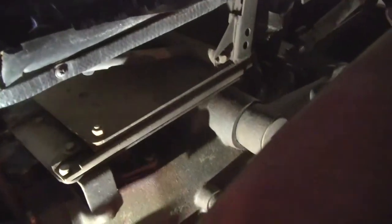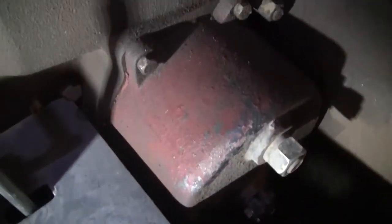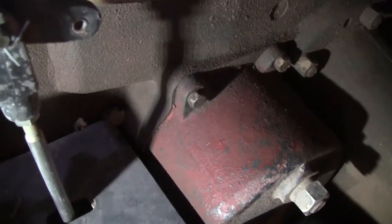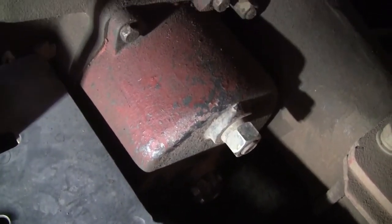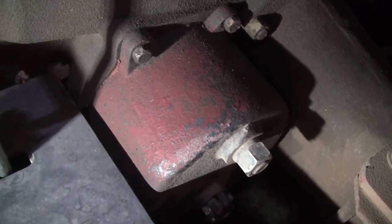We got our moving blanket on the ground to keep the rocks from embedding themselves in my back. Okay. So, there is the outside housing for the left brake. And it's got 4 bolts, 2 top, 2 bottom, and then the whole thing pops off. There's a piece of linkage underneath that comes off. It's just a pin and a cotter key, so it's no big deal to get them apart. But I need to pull this thing off and see what's wrong with the interior of it.